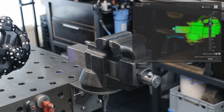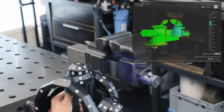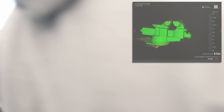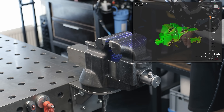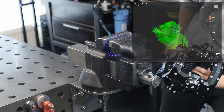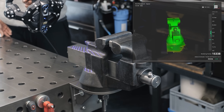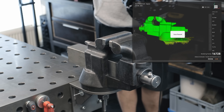I'm showing you this entire scan without any cuts, just to drive home that it really does work as well as it looks here. You can see the tracking is extremely reliable, and I've never once encountered the issue of having overlapping scanning data after the occasional tracking loss. Tracking loss can still happen with this system, but it really only does if the tracker can't see enough of the markers on the scanner — generally when your body is partially blocking the line of sight, or if the scanner is hidden behind the object. The important thing is that even if this does happen and you lose tracking for a few seconds, it's no big deal, because the tracker is very good at immediately and precisely finding its position again as soon as the scanner gets back into view. So even walking in front of the tracker in the middle of a scan isn't actually going to mess up your scan — it just quickly recovers once it can see the scanner again. Another very convenient thing is that you can pause the scan at any time and then resume and still get perfect tracking.